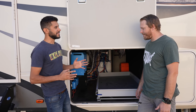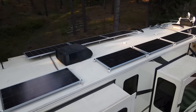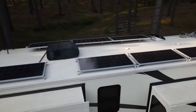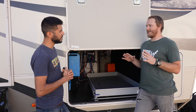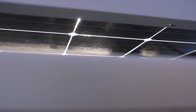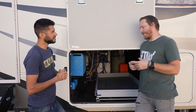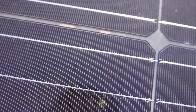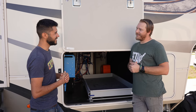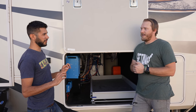Let's talk about the solar panels. We have Hightech Solar panels, 200-watt. We have six clear panels and six standard with a white background. The clear panels are bifacial — the marketing is you can get maybe up to 25% more power per cell through the back off reflections. They're probably a little too close to the roof to actually see any benefit, but they do look nice.